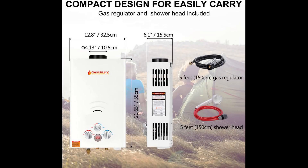It drains away residual water, preventing ice from freezing in the system. Considering this is a small unit, its maximum power output of almost 68,000 BTU is quite impressive. Although Camplux primarily designed this water heater for outdoor use, you can use it indoors as well. Make sure there is adequate ventilation wherever you install this heater — a duct or flue pipe would be ideal.